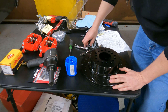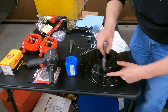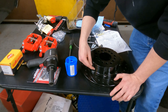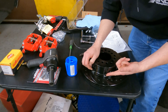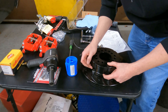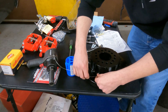Whenever the safety wire is on here, we can't unscrew the bolt. So we need to come from the far side and try to kind of S-loop it. It gets a little difficult because we can't take the twist all the way around through this little crevice — it's just too tight. But we can make sure that the outside wire that comes around is in a way that it is going to be pulling, so neither of these can be loosened whenever it's all said and done.